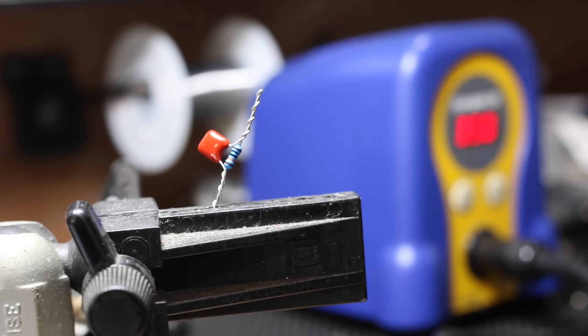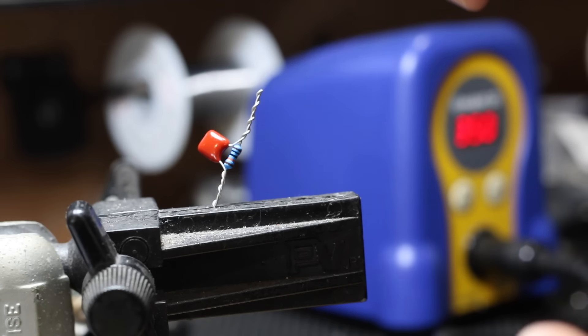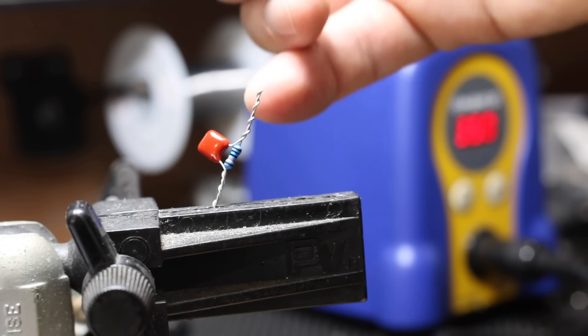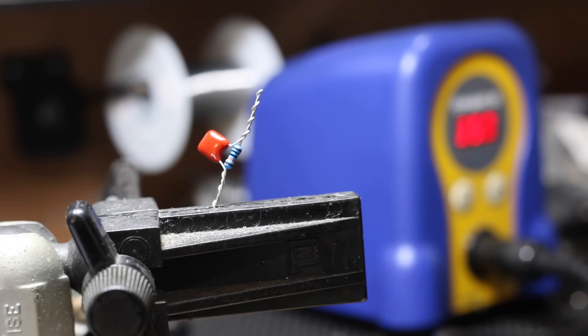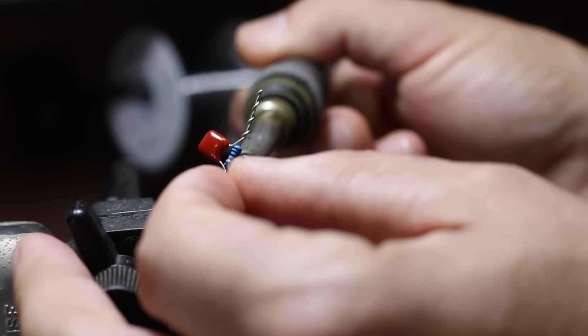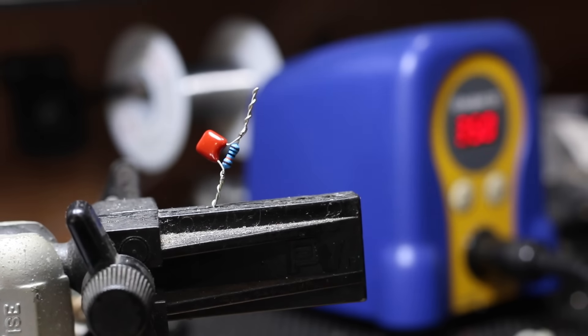I find things start to work from around 10k up to about 1 meg, though somewhere between 10k and 470k-500k seems to work really well. I've got 100k on here, which is a nice tweak. The great thing is it doesn't have to be a full-on bass roll off — you can just reshape the low end of your pickup. Once twisted together, I just touch a bit of solder to seal it and lock it in place.